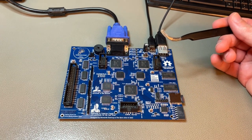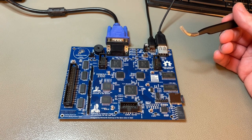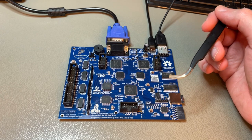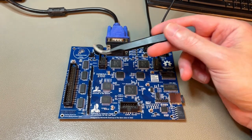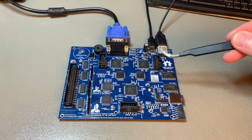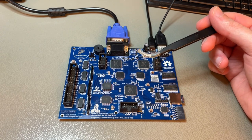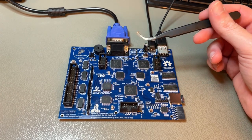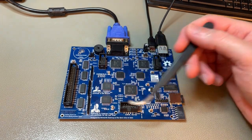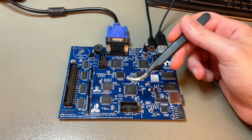The only black boxes in this system are the two CPUs and the I/O controller. For that I have another project called Talus, in which I'm designing a RISC CPU capable of four different parallel operations every cycle — I have a separate video series on this channel. But here in the Cerberus project I treat the three processors as black boxes while opening up everything else, so you can see what computer architecture actually is, down to individual gates.